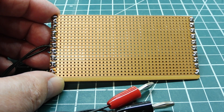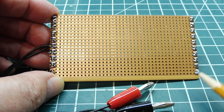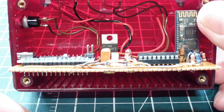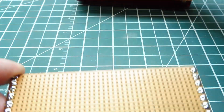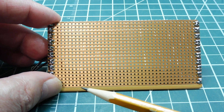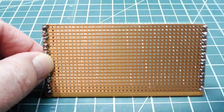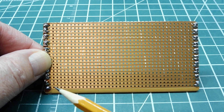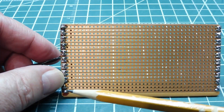Let's have a closer look at this heating element. The dimensions of this element are ten and a half centimeters long by five and a half centimeters wide. You can cut it to any length you want so it fits into your enclosure. If you have an enclosure with slots you can cut the board to size and fit it in, keeping the electronics inside warm. On this board we have twenty strips all the way down from one to twenty. We apply our power to the top left-hand corner strip, and the power goes along the first strip, gets jumpered over to the second one, goes along, gets jumpered over, and zigzags all the way down to the bottom corner.